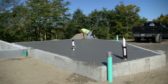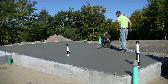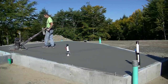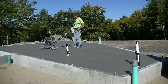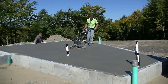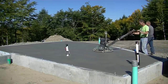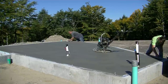So I said there's got to be an easier way. I backed up my truck and grabbed a little mini trowel — this is a 30-inch power trowel, I've got three of these. I just finished it off by power troweling. It was actually pretty hot today, about 80 degrees and out in the sun — when you pour concrete in the sun on styrofoam like that, when it starts to go it really starts to flash off quick. This was the easier way for me today, made finishing it ten times easier. It's got ten-inch finish blades — the blades are pretty small but it finishes really good. It doesn't have a lot of weight to it, so you definitely don't want to wait too long before you hit the floor with it.